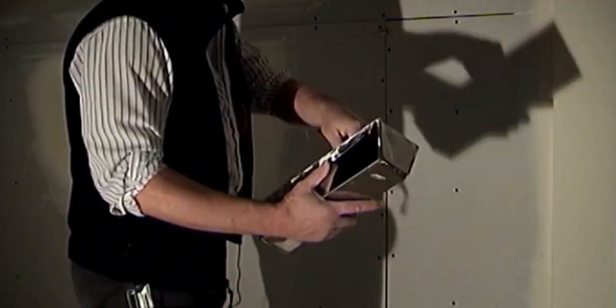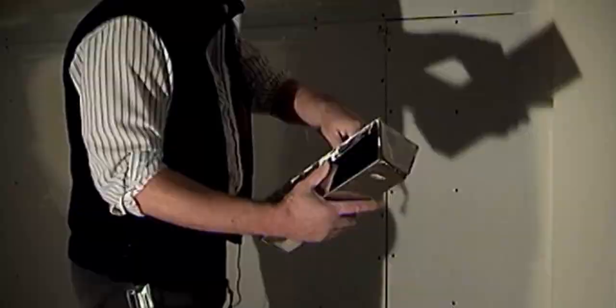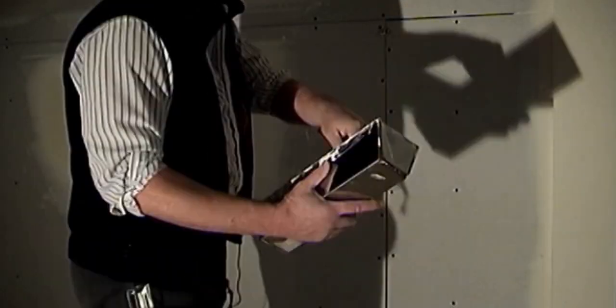When you apply your drywall tape onto the butt joint, use your 6-inch knife to guide the drywall tape, and set it into the taping compound. Make sure as you apply the drywall tape all the way across the butt joint, that the tape is centered on the butt joint, and not running off the butt joint. Any joint that is not taped will crack.